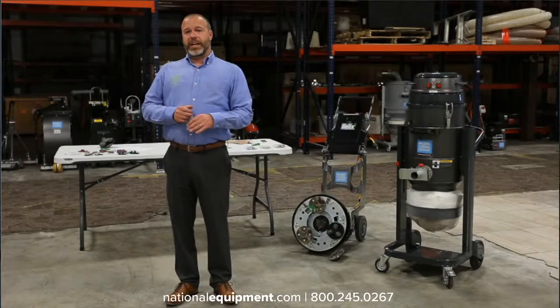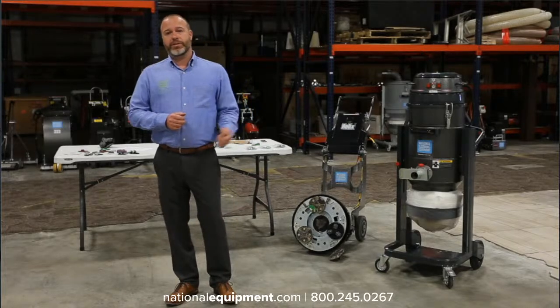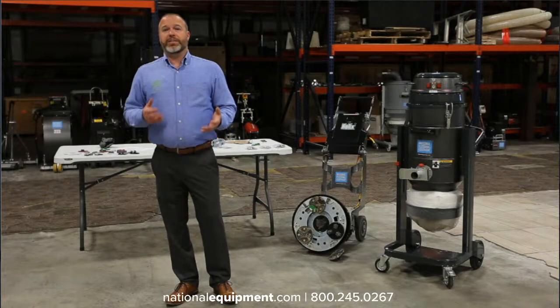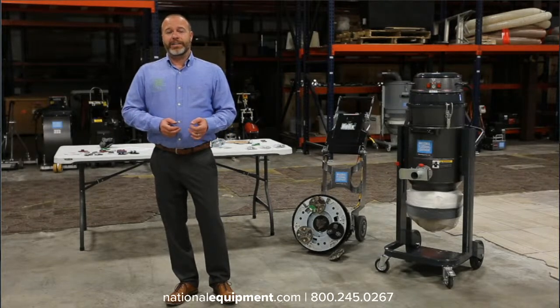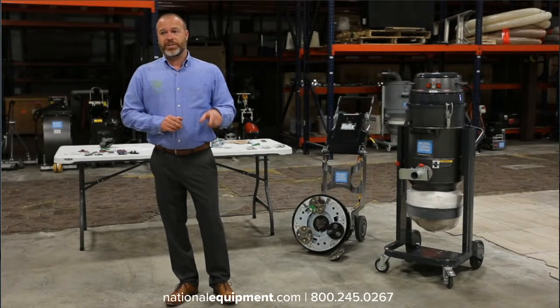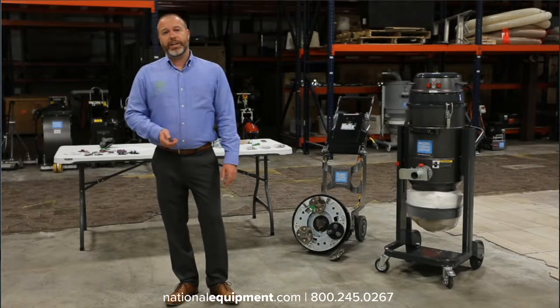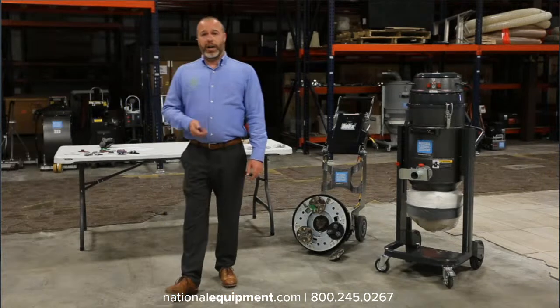I couldn't get it to stay in the work. And I actually called Dave, our director of international training, and said, Dave, I've done everything I know what to do. Why isn't this working? He goes, oh, yeah, down there they use an epoxy reinforced thin set, and that stuff is just a beast to get off the floor. The only way you're going to do it is with a carbide chip and grinding.